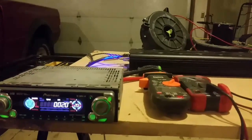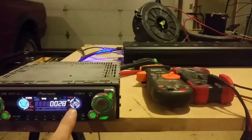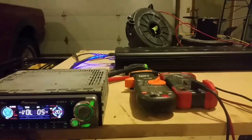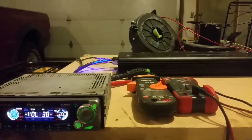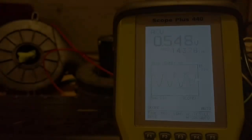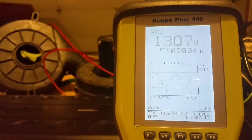To show that this is actually being driven by the amplifier, I put a little piece of tape on the motor. They're playing a 20 Hz frequency. As I start to turn the volume up, the motor will start to turn. What we're looking at on the oscilloscope is a graph of the AC signal coming out of the amplifier. As I turn the volume up, our motor will start to spin, and we should see a nice round wave — peaks and valleys are nice and round, so we have a good clean signal.